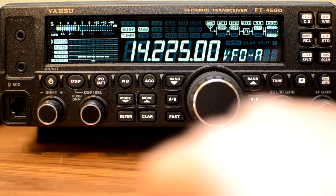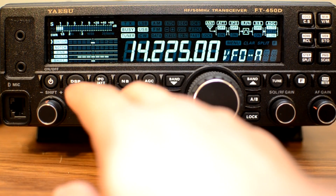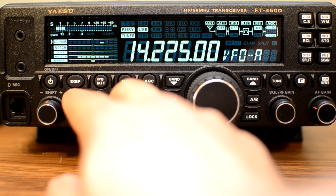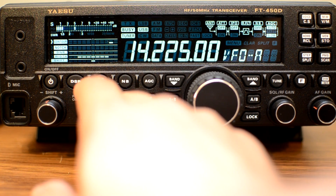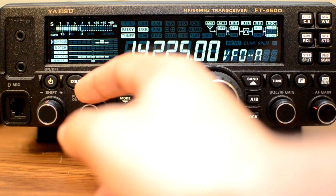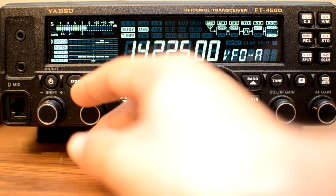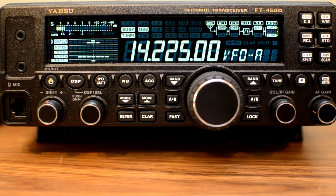To turn it on, you're going to hit DSP — that'll start you at Contour. If you press it once, right now we're in the Peak mode. You'll notice this gives a little peak, and moving it will peak up a part of the passband. They actually made it a little bit easier in that part. If you press DSP again, it'll change how much it's peaked — this peaks it even more; as you can see, the little pyramid shape is larger. Moving it changes where in the passband it applies. It kind of selects a particular part of the passband, bumps it up, makes it easier to pick out.